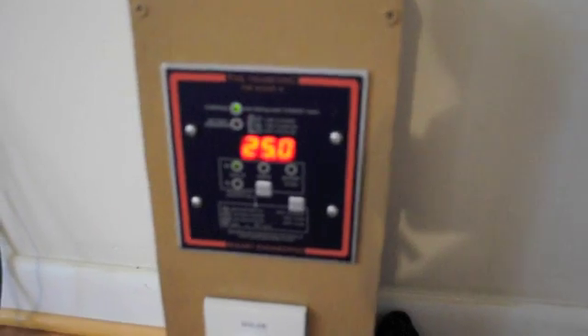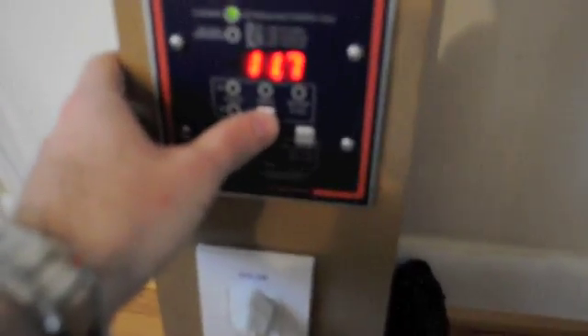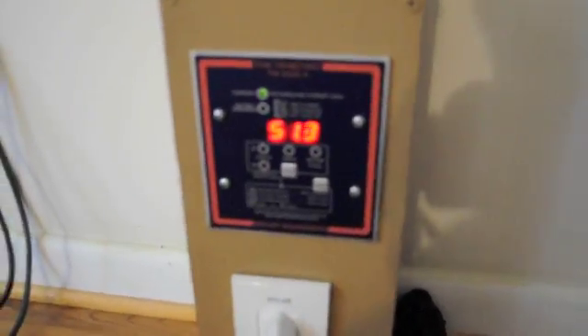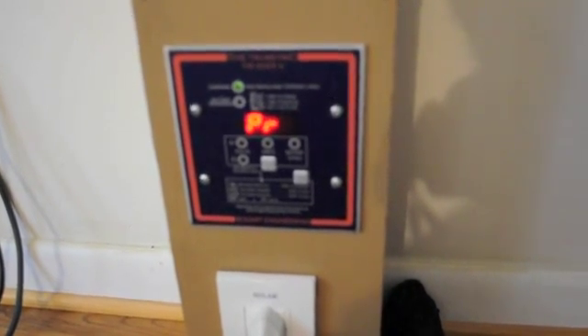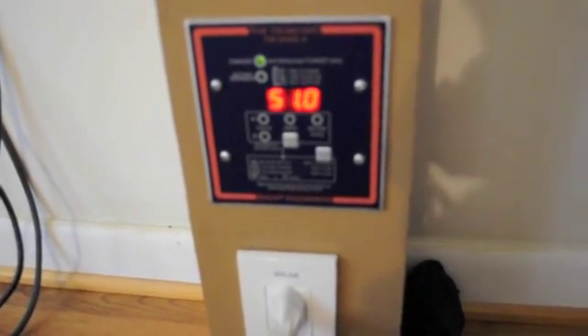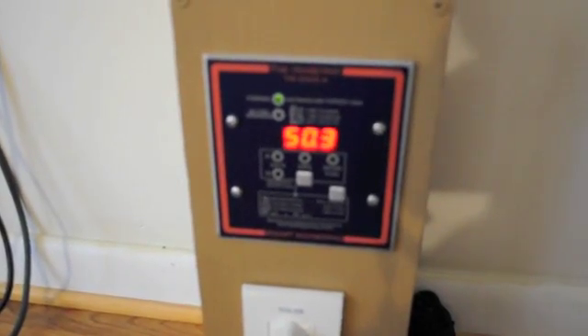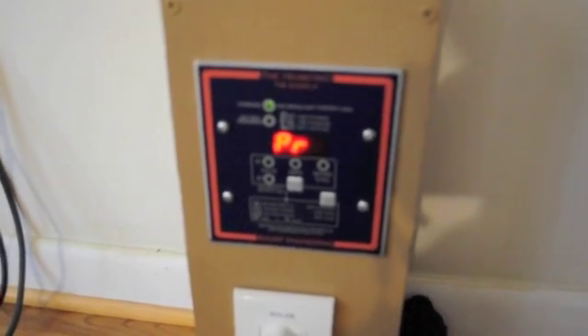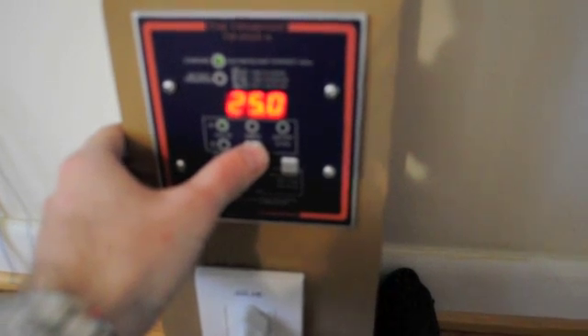I'm at 25 volts. If you hold the button down for five seconds it shows more data — like amp hours used since last charge, and days since I equalized. I equalized yesterday so that resets daily. It also shows PR, which is watts — so I can see the surplus wattage coming in right now is 51 watts. This thing is super accurate; it updates every half second or whenever the sun changes. I could not live without it — it's the first thing you should buy for a solar setup.